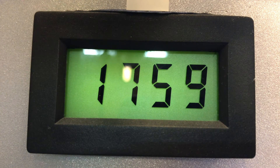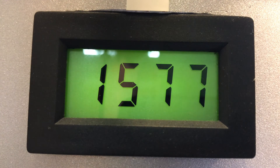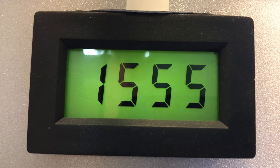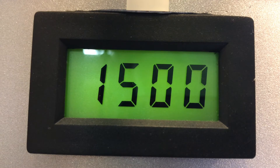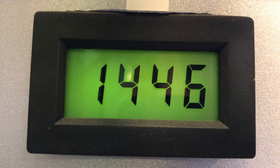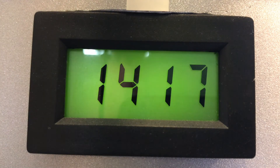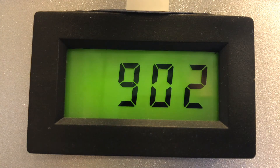Now we will see how long turbo stays bright before stepping down. After about 2 minutes the light rapidly decreases brightness — at that point the light is only about 40 degrees hot. In my opinion that's not hot enough to start dimming, and it should keep 1800 lumens for at least 5 minutes. It's a big flashlight and 1800 lumens is a lot, but not too much for this size. After about 5 minutes it stabilizes at around 900 lumens at roughly 60 degrees, and should run at that level for about 1 hour.